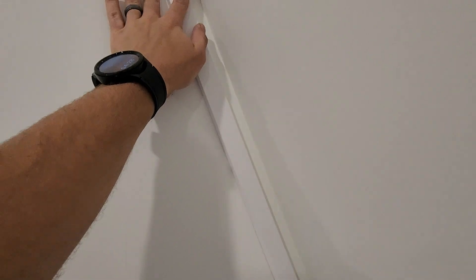Trying to do this one-handed with a camera — never an easy job. Up top I'm going to give us a couple of mils spare there for expansion and contraction, and that'll be filled in anyway with a little bit of gap filler at the end. This is what I'm talking about — so after I cut all the lengths...